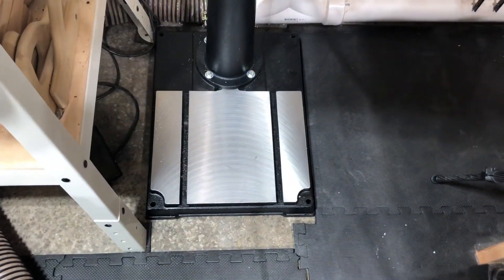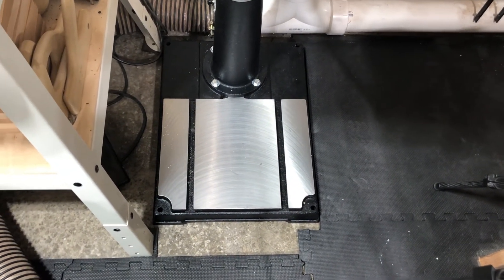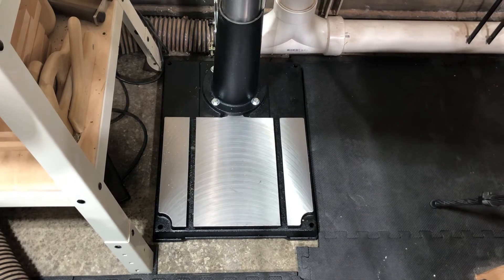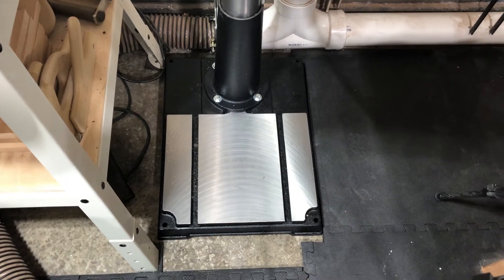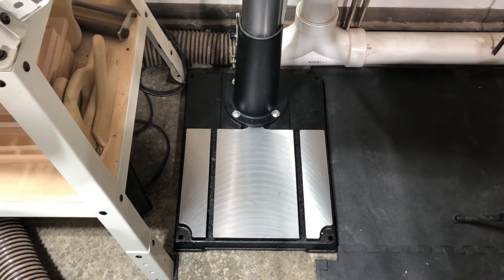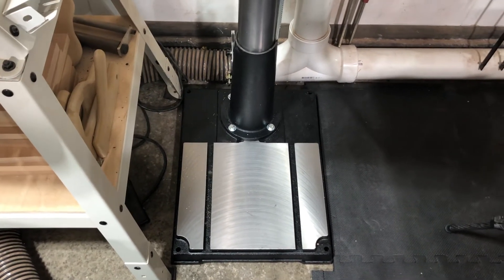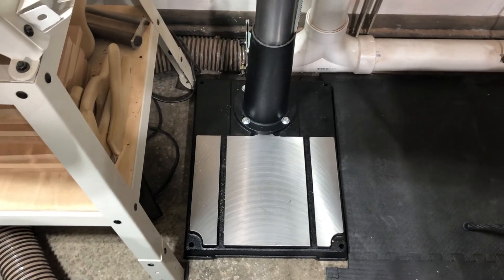Looking over the drill press, it has a nice large base — one of the largest I've seen. Everything came packaged in cosmoline grease, which was a bit of a pain to clean off, but WD-40 did a good job. Then I stripped it all to make sure there were no oils and waxed it so it wouldn't rust.